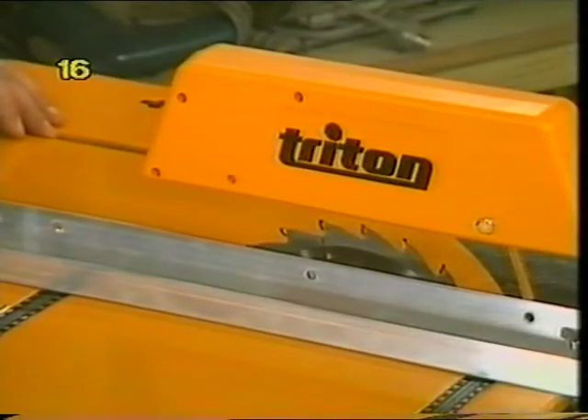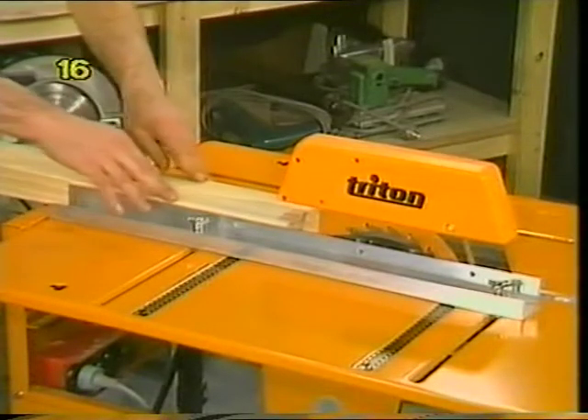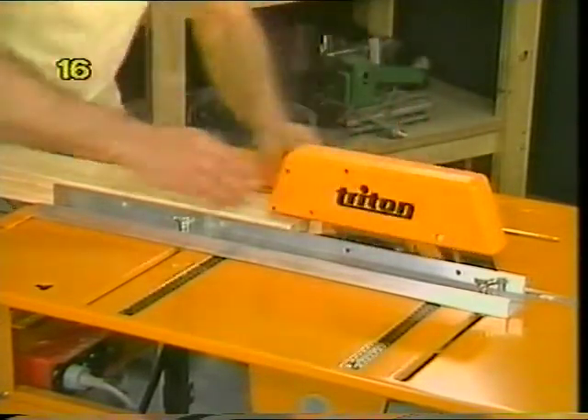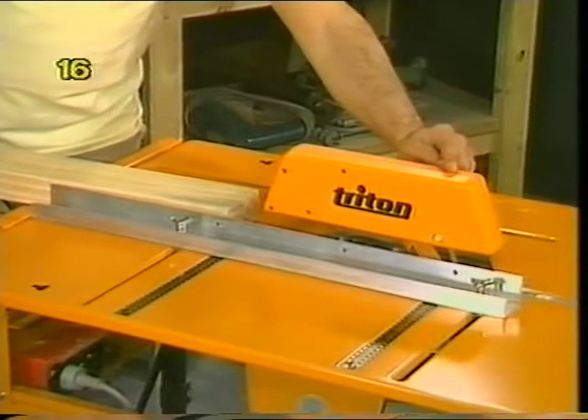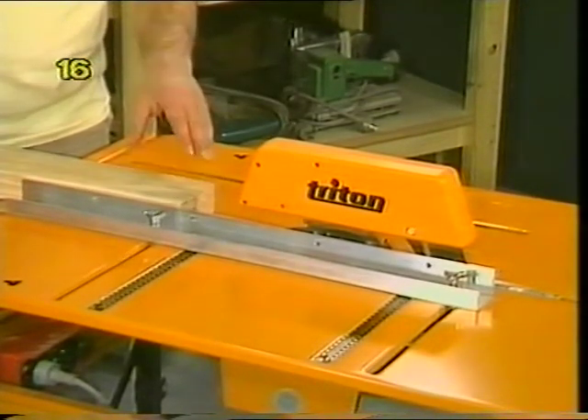The table saw is probably the most versatile and useful piece of equipment you're ever likely to use in your workshop. However, it's also the piece of equipment that probably causes the most accidents and injuries — perhaps because the saw blade is exposed and people become complacent. You can use a table saw very safely if you follow some rules all the time. Always keep your fingers clear of the blade — rehearse the cut first, determine where your fingers are going to pass, and make sure you've always got the safety guard fitted and lowered so that only the wood can pass through. When through-ripping, you must have the riving knife fitted and the safety guard on every time you're cutting all the way through.